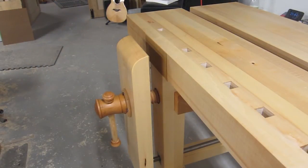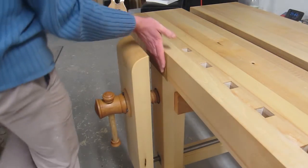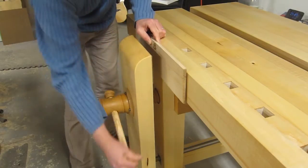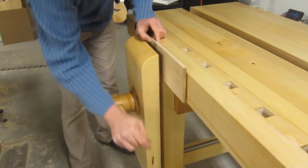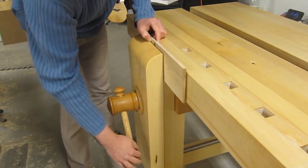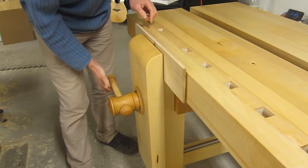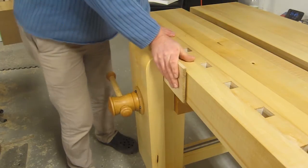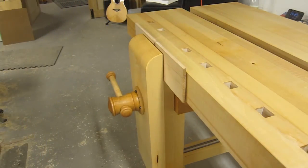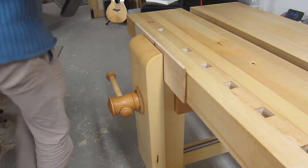At the other end we have the leg vise, which is 9 inches wide and 2.25 inches thick. Leather lining again assists with grip. The bottom guide pin is at a very slight angle, creating a pivot effect around the screw. This creates some stiffness when turning, however, with light pressure, it achieves very strong holding.